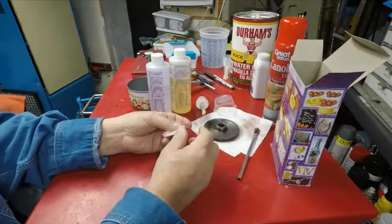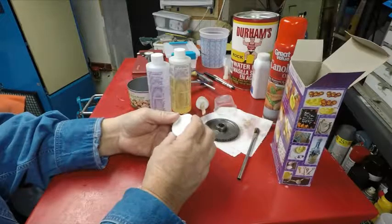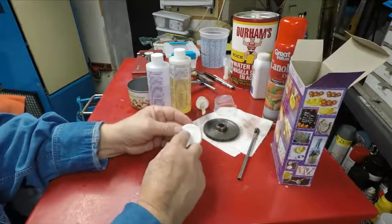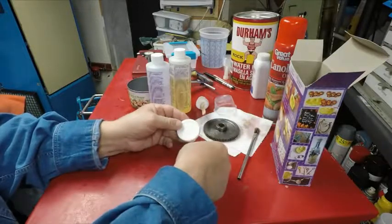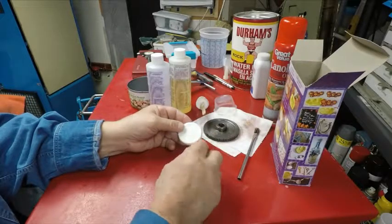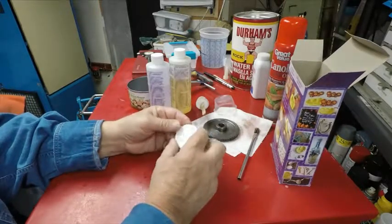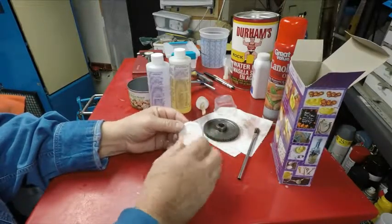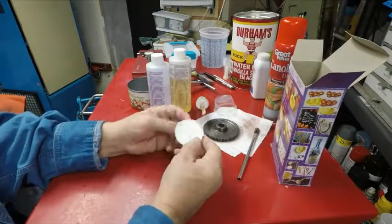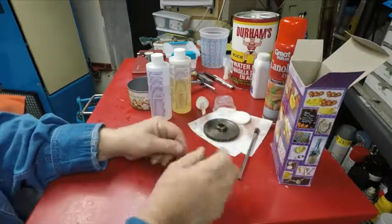Now, if you want to make a part for something, your bike, car, anything, if you had a plastic part you want to make, you could maybe get Play-Doh, push your part down in there, and make an impression of it, pour it, and then you have it. Or you could even pour it bigger like I'm going to do, and machine it down to what you want. You can drill this stuff, tap it. I mean, it's fantastic stuff.